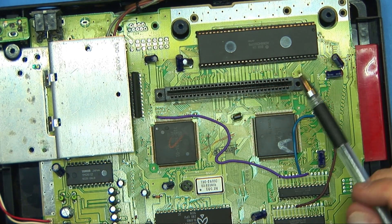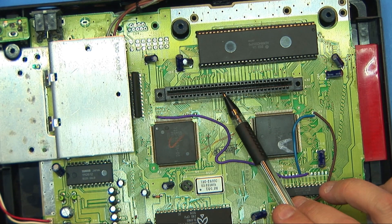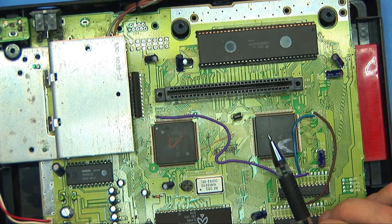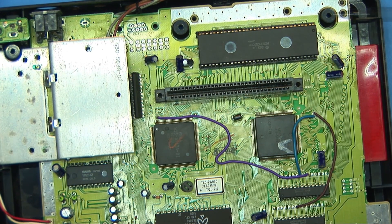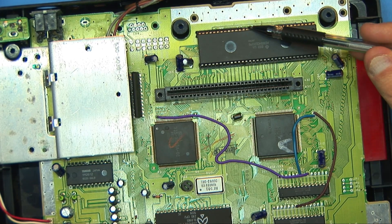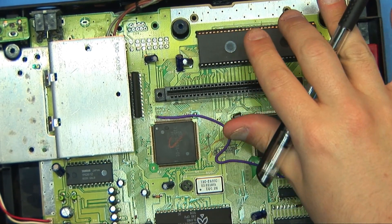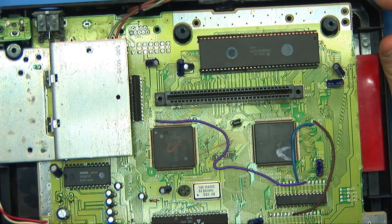Now, what a lot of people will do is they'll put a second oscillator in here for, say, 10 MHz or 12 MHz, whatever they want to use, and they have a switch in the back which will switch it back and forth. You can do that — it requires buying another oscillator and wiring it up. Another way is there is a 13.4 MHz signal on the card slot, and you can actually use that to run this at 13 MHz versus the original, which is about 7.6 MHz. What people do is there's a pin they will unsolder and pry out of the board. I really didn't want to do that, so that's why I socketed the CPU — I can remove it and put it back with one pin kind of hanging out, so it can be returned to stock very easily.